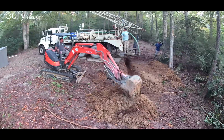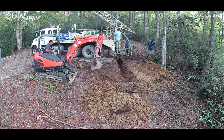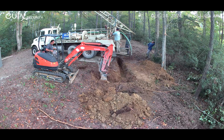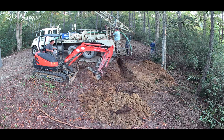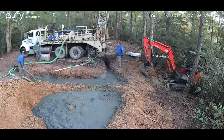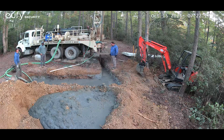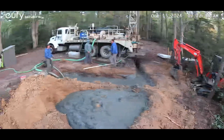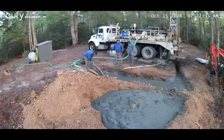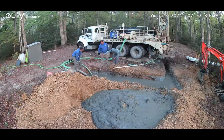All the while they're installing a sheath around everything, a plastic tube that's going down into the earth that'll butt right up against the bedrock and protect the water from any contamination that might be present in the groundwater. When they're done, they put grout in the mud pit and seal the whole works in a casing of grout, which is pretty cool, and it protects it and makes sure that it has some rigidity over time so that things can be repaired, etc. So that's what they're doing here. They're going to work all that grout down 640 feet.